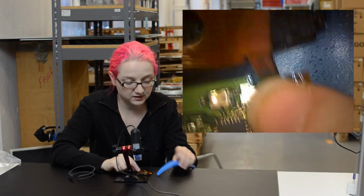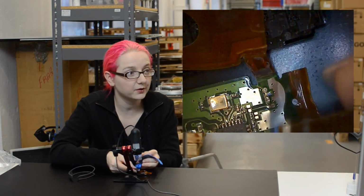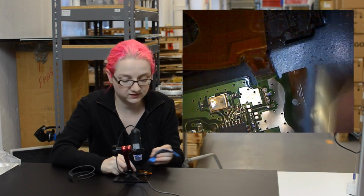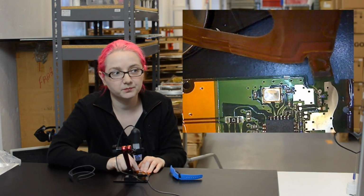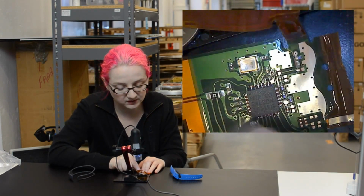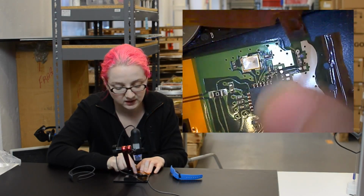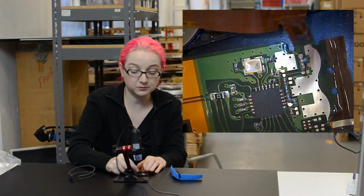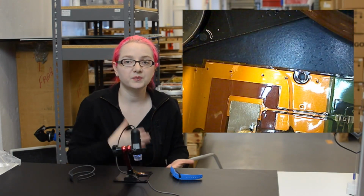And then over here, this got torn a little bit, but there is an antenna that goes down the band. So this is the trace antenna, and if you look up the nRF24LE1, which is this chipset, you can see this is the analog front end for the antenna, RX and TX, goes all the way out to the band. So it's pretty simple. There's just one chip, does processing and radio. The nRF24 can go quite a few meters. So this is definitely something that can do long distance communication, receive and transmit.